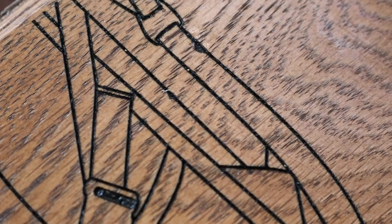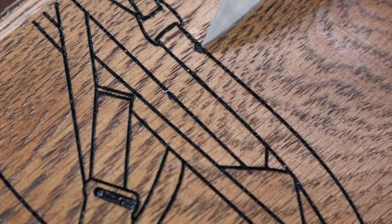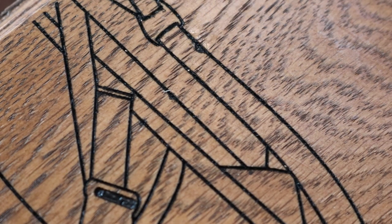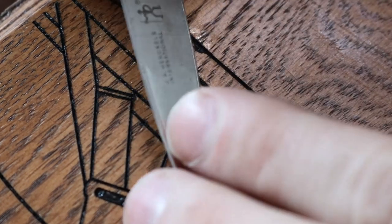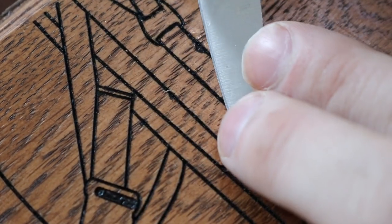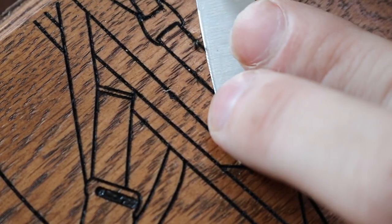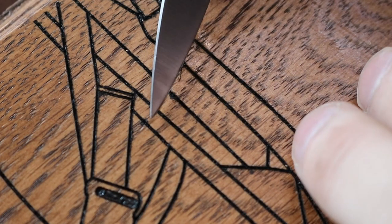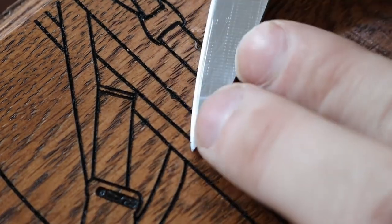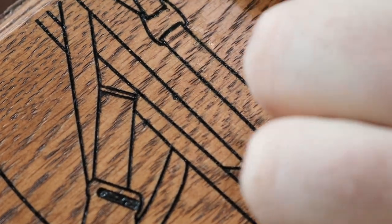The paint had time to dry and I'm inspecting it closely. What I'm mainly looking for is any imperfection or any spills of the paint underneath the masking tape. And I use a utility kitchen knife. The reason I like that is that it'll remove the paint without scratching the wood, and I can bend the blade slightly without the blade breaking off like with a box cutter, for example. So it worked pretty well for me.